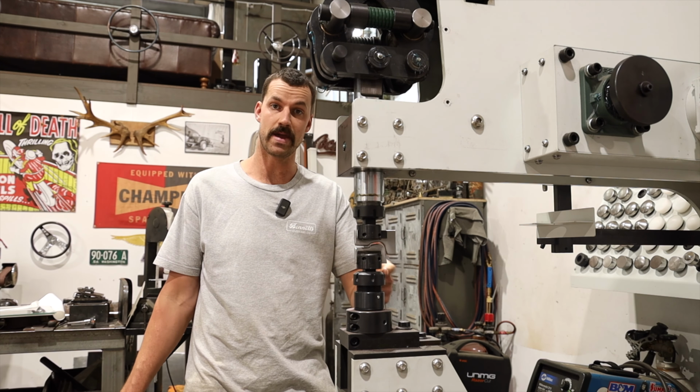What I could do is actually drill a couple holes pretty soon because I'm happy with where everything's going to be sitting. I might just do a straight edge off the bottom or off the front to the back, just making sure everything's there, and then we could actually kind of tack it or at least drill a few holes so that we could cleco it into place and then have a look at our references, making sure we're kind of in the right area.